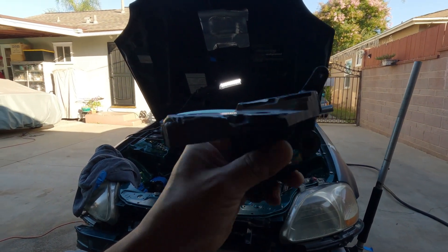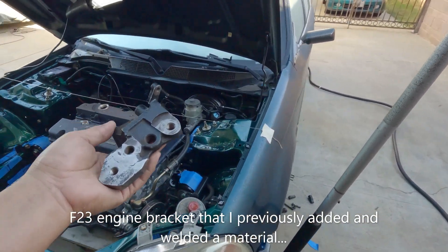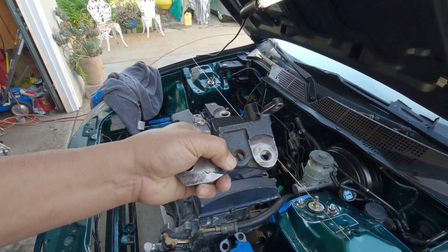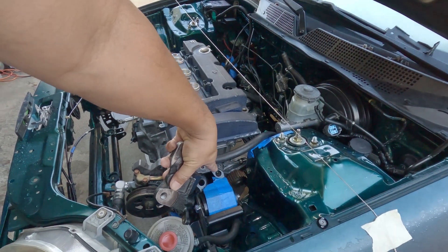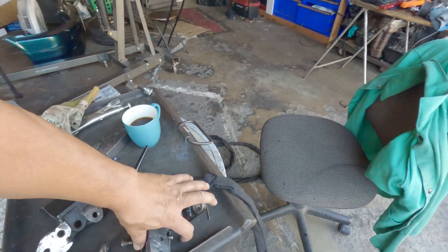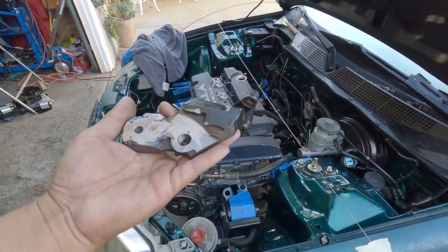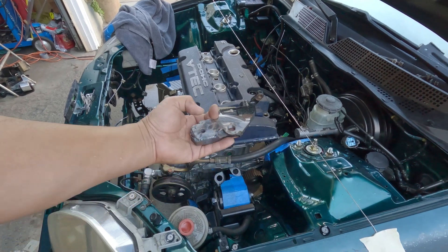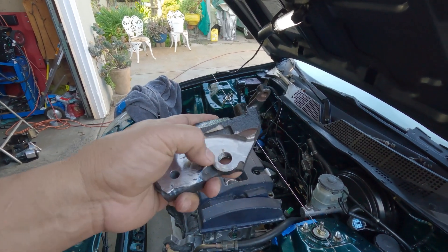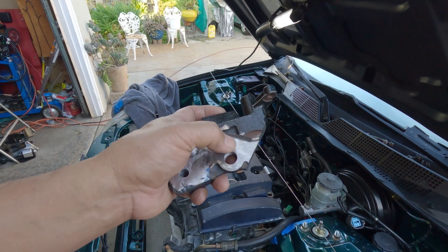I just chopped it up at the correct angle. This is the original one — when I place it on there, this hole right here in the middle I can use as a reference, and that's what I did. I just centered it through there, found the center using my center punch. That first hole right there — I'm going to widen that hole and create a thread so I can put a bolt or stud and bolt it on. I'm going to completely weld this spot because it was off-centered, just covering half of it.